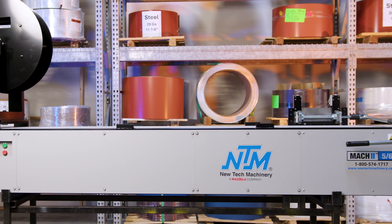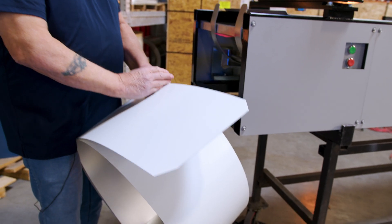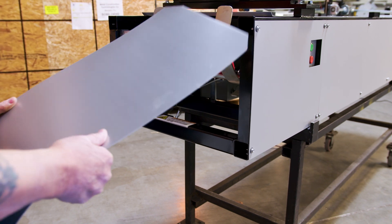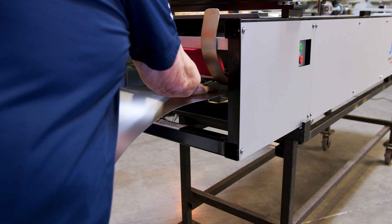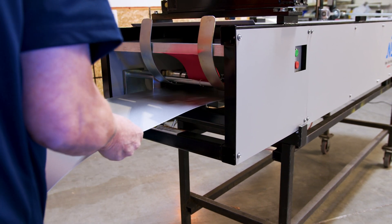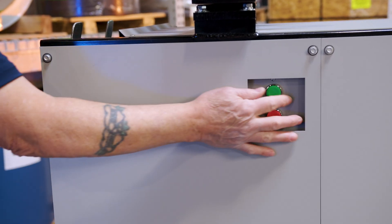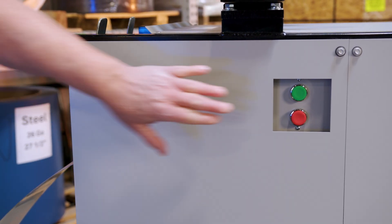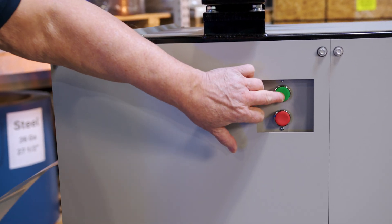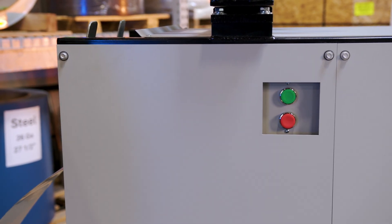We've prepared this coil by trimming the corners off — we don't want to trim a big lead-in and waste that much coil. That's a foot of gutter that you can get six bucks for. I'm going to feed this in — we're not up on the reel right now, the coil is just sitting on the floor. Tap the button and you'll be able to tell when it grabs it. Once it's got a hold of it, you just start jogging it through a little bit at a time. Never put it on forward, hit that button, and wait for it to come out the other end — you'll have a big mess most of the time.